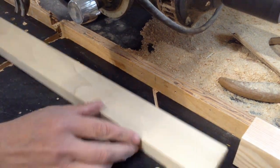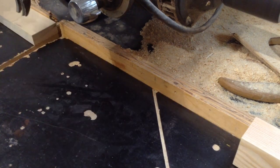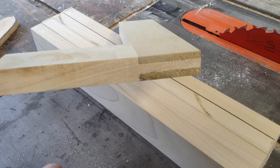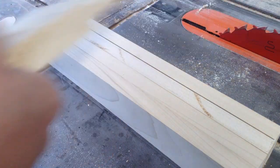You can make these doors a little oversized and trim them. If you're not used to making doors, I recommend that - that's how I used to make them - but I've made enough of these at this point that I usually make them close to size. These are inset doors, so there's probably going to be a little bit of trimming, but I basically make them to fit the opening.